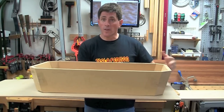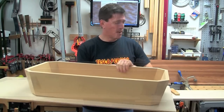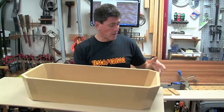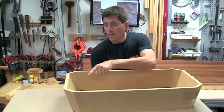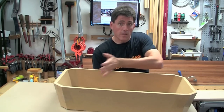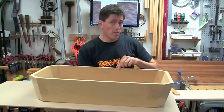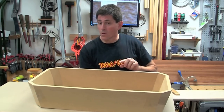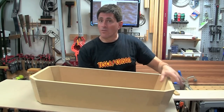So with this being the middle section, assembled with tape, I've done this so many times now, I'm good. You can see that all these angles here are unique. All these are different compound angles. All 8 of these are unique. But these ones here are the same, except that they're basically leaning the opposite direction. So if I wanted to actually lay out these cuts by using the mock-up parts, it would be possible, as long as I take the left side and I put it on the right and the right onto the left and put them face down.